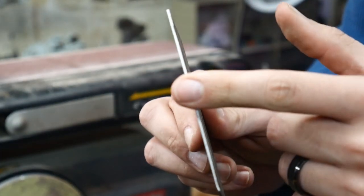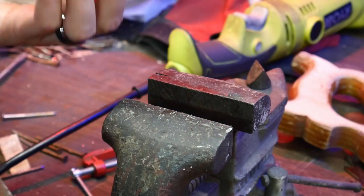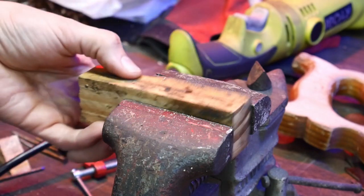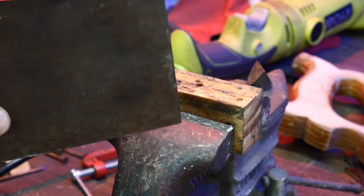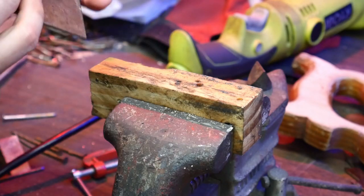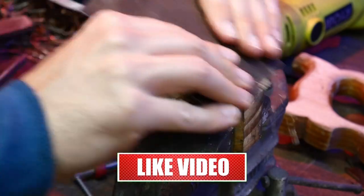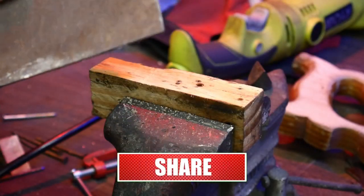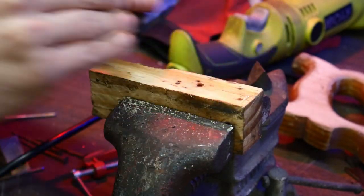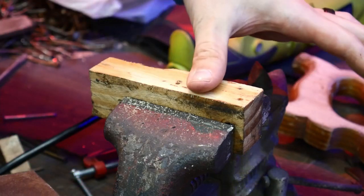It's not as precise, but it's a quick and dirty way to get a 90-degree angle on both sides versus hand filing, and it will take a little practice to get it right. Testing the belt-sander side: I experimented pushing versus pulling and it worked really well — I took off material faster. I think it was partially because my attack angle was better. Some people also bend their card scraper with their hand, but you need a more flexible metal; it will take off more that way. I ended up with a very smooth surface.